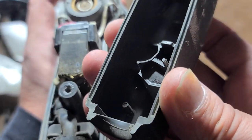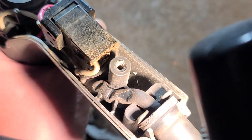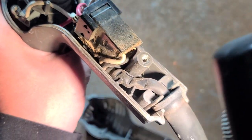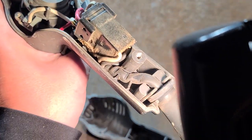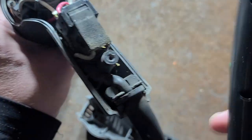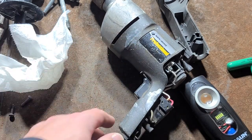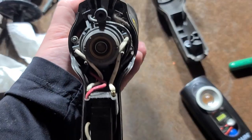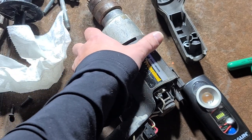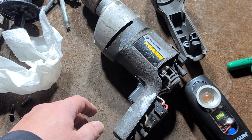There's something interesting in the handle area: instead of a traditional separate buckle with two screw holes for cord retention, they used a special in-molded section in the handle that just pinches the cord — part of the cost cutting on this drill, eliminating those extra screw holes. Anyway, that's the Black & Decker 1309 Hole Gun half-inch drill. I'll replace the cord, but it just isn't my favorite half-inch drill. It'll become a comparison tool for future reviews, or a loaner — and one I won't be heartbroken if it doesn't come back. Really appreciate everyone watching — see you next time.